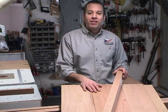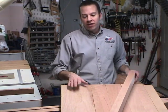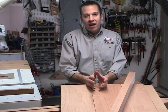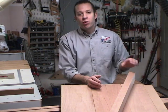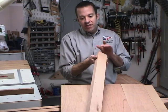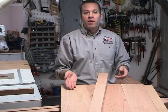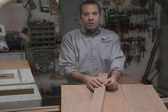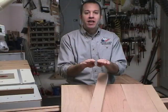Here's the wood I have to make the top — some really nice 8-quarter cherry. Like other hardwoods, the flat-sawn face of these boards has wide cathedral-type grain that I find difficult to match for a nice consistent-looking top. So I'm going to take advantage of the edge of the board, which is a tighter grain. Since I have these nice thick boards, I'll be ripping off an inch and 3/16 off each one, turning those boards sideways, and gluing them back together to form the top. Using this method, I have some unique opportunities to book-match neighboring boards.